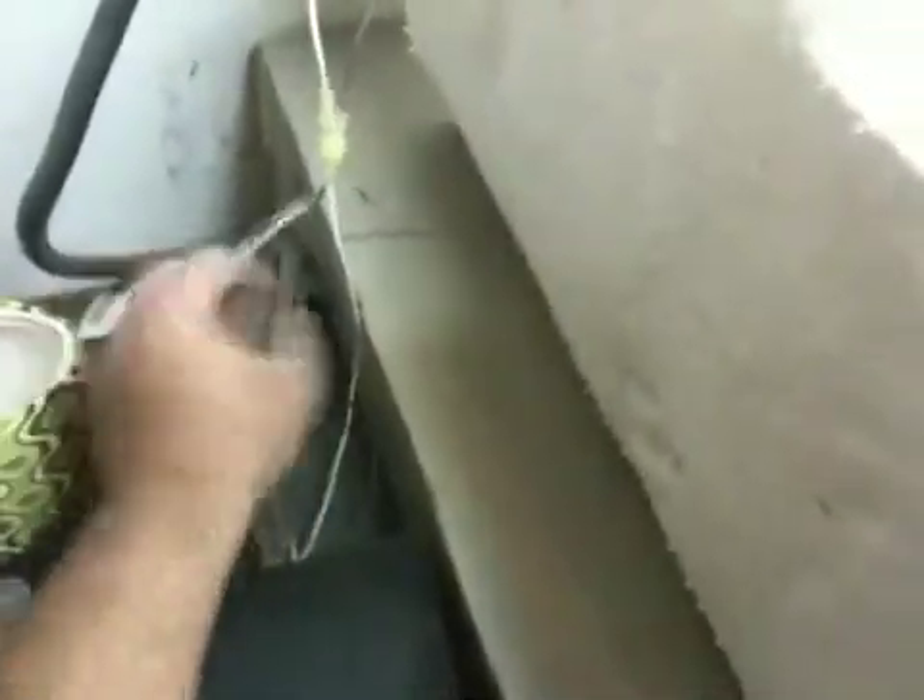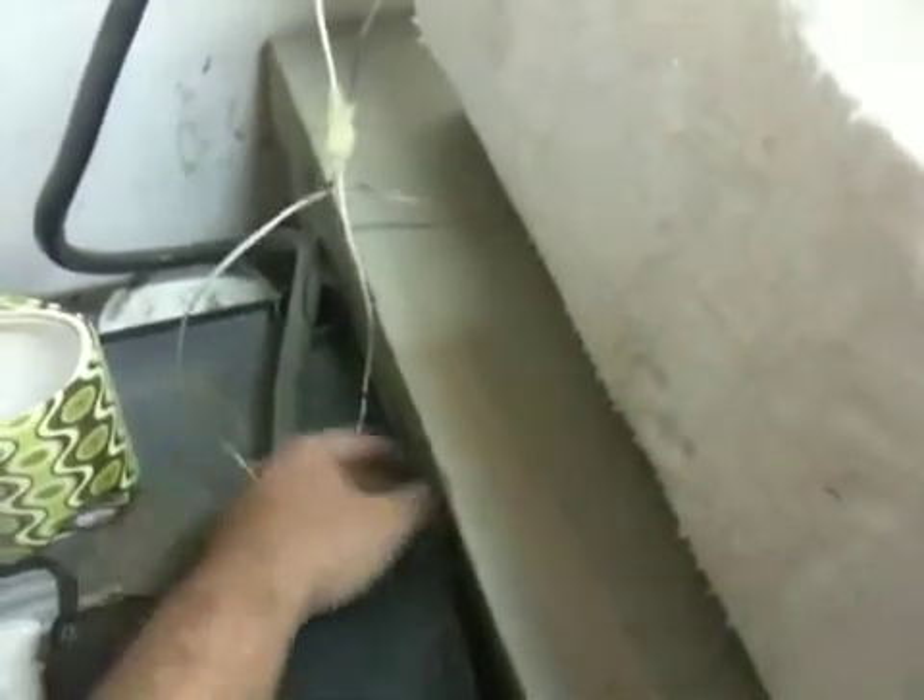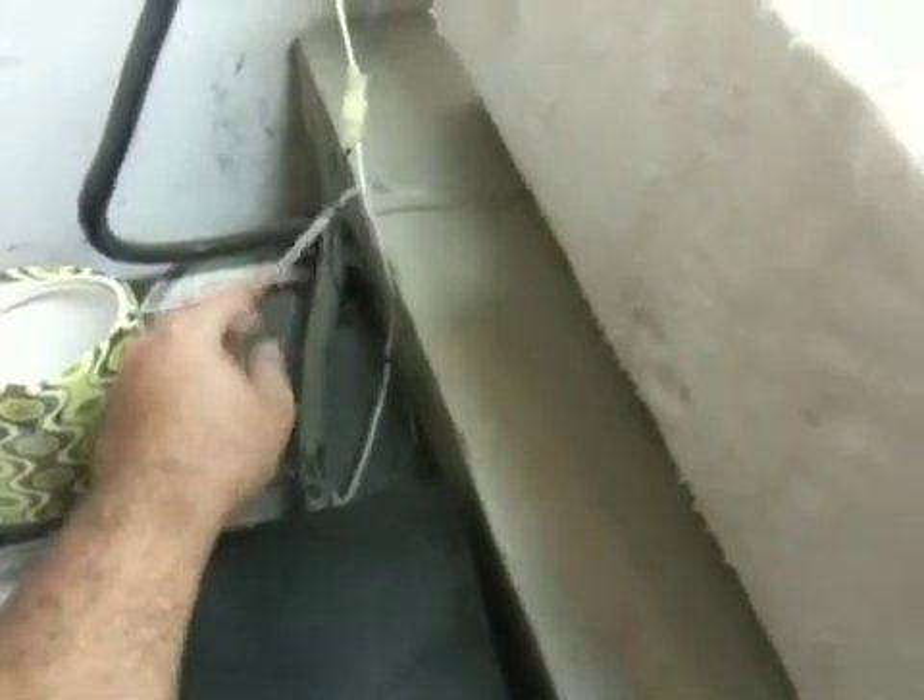You've got the two 110 lines coming out — the black and white — that's a 220 supply. And here's the thermocouple, which is actually in the top here. It's right there in the back, in the top middle — I know it's a little dark, but that's where I ended up sticking my thermocouple.